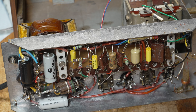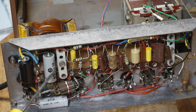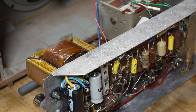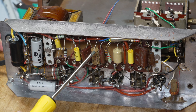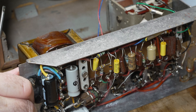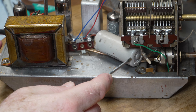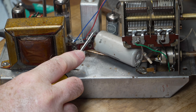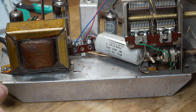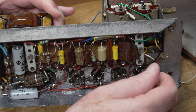Just looking at it on the camera - we have this one still in circuit down here, that was probably changed in the 60s or 70s. I'm not too happy about that one, and this one - I wonder why they just left it. Is it the main filter cap? Yes, so this one will have to be changed definitely - it's in circuit. It's a 40 at 300.